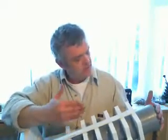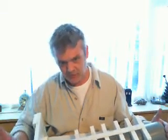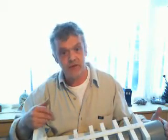Now, the best way to cut that off is starting at one of the level ends on the length of pipe that you buy, measure up 60. Actually, I measured up 62, sawed it off roughly. It just makes it a bit easier to handle. So measure it up 60 and put about 10 marks around the circumference. Now, normally on the other bit of pipe, you'll have a flange. If you stick that flange on and line it up with the marks that you've done, you can draw around the flange and you get a neat line that's level. Then saw through that line.